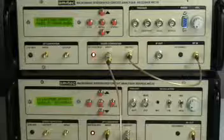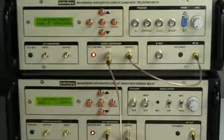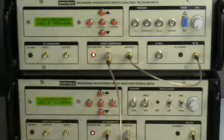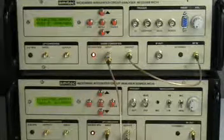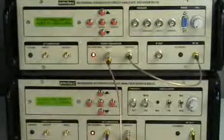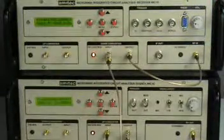The receiver has trigger inputs for transmitter and stepper motors. In case an automated display for the measurements is required, a stepper motor could be used. In case an automated frequency analysis is required, a trigger from the stepper can be used. We also have a volume control which gives you the demodulated audio level into the speaker.